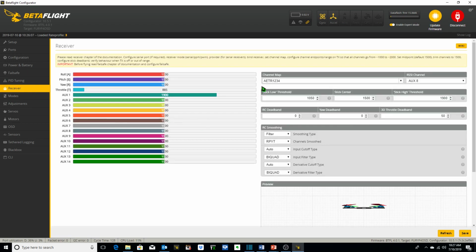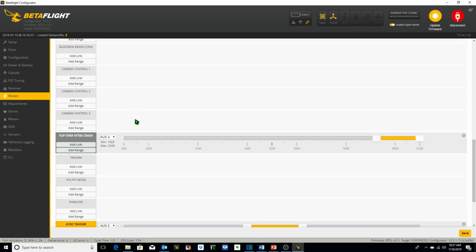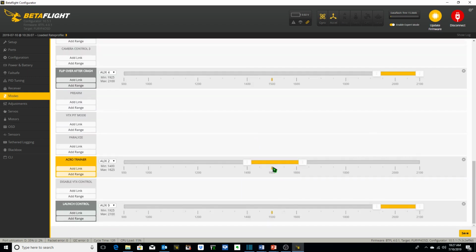Receiver tab, I've always got my channel mapped to AETR 1234, and I've got the RSSI set up to aux 8, which is channel 12. Modes, I set up my mode. I've got an arm switch set up on aux 1. I've got angle and acro trainer set up on a switch, and when they're not in angle or acro trainer mode, the little yellow blip is over here, which means it's in acro mode.